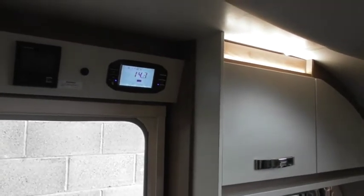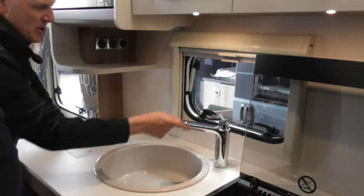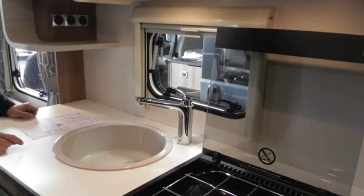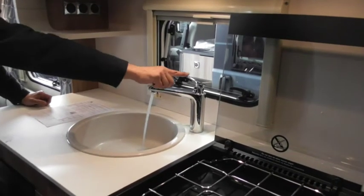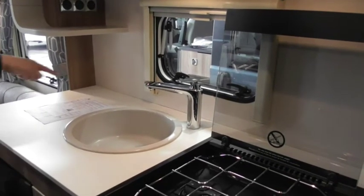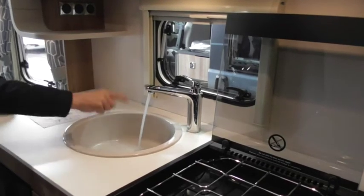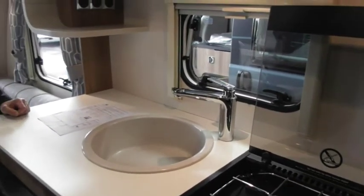Okay. So what we do then, we come to the cold tap in the kitchen. Or the cold side of the tap even, because there's only one tap. Cold side, operate it on that. Obviously we'll get a lot of spluttering in there to start with. And obviously me putting the pipe in and out, outside obviously hasn't helped. So what we want is that. So once we've got a solid stream of water there, the reason I start on the cold is because you remember that pipe, if it's curled up, it's sucking air, that is the quickest point to find that out. If it's just nothing coming through, just go out and check the pipe is straight. It is sucking water. Get the water coming through like that. Then turn to the hot side. So on the hot side, we're doing exactly the same, getting the air out of that pipe.